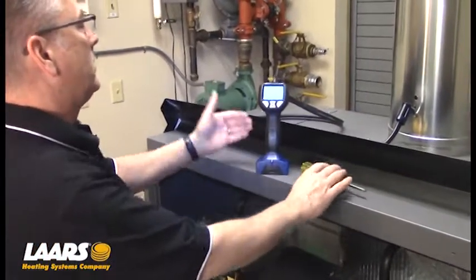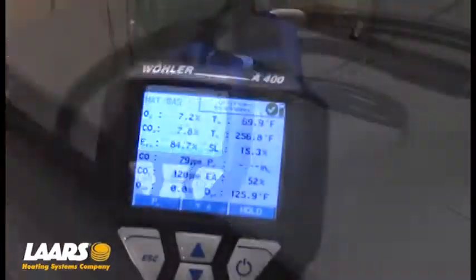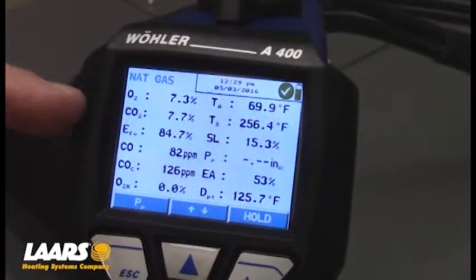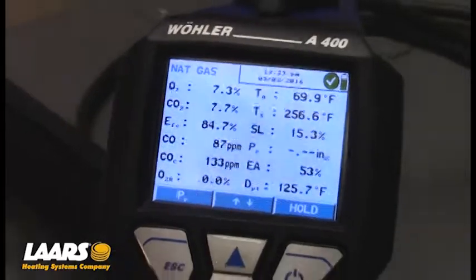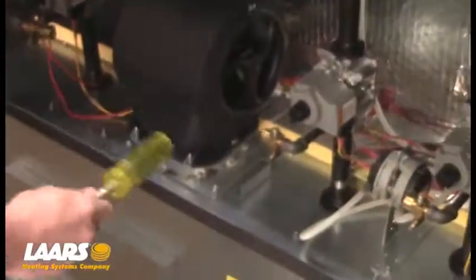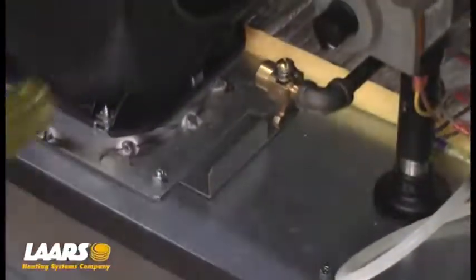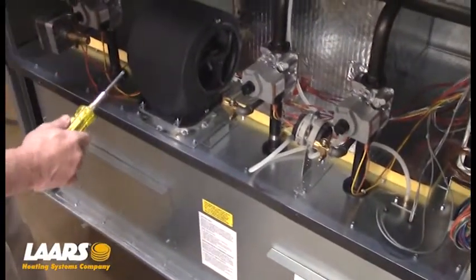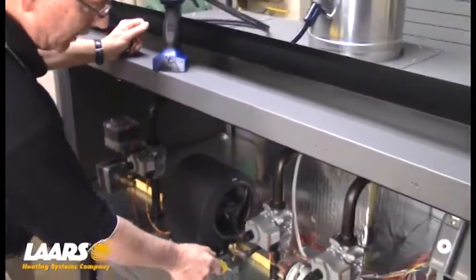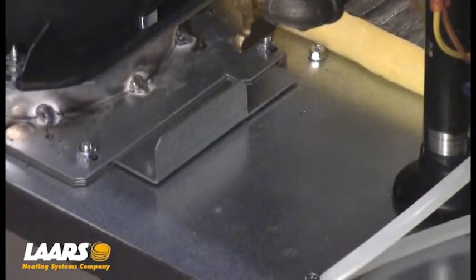As we can see, I opened the air shutter and now our CO2 is dropping — we've got excess air. So we're going to go back in and readjust it. All I'm going to do is tap on that air shutter, and if I've got multiple blowers, I want to do it equally — you can measure it. When you're done and you get it down to 8%, you might want to take a magic marker and just make a little mark there. That way every year when you come back to do combustion readings, you can tell where it is. Keep in mind, if you've got vented or inducted air, you want to put the cover door back on the boiler.